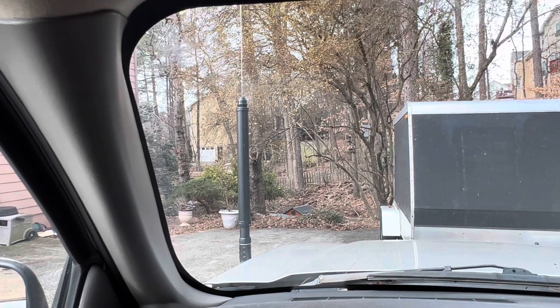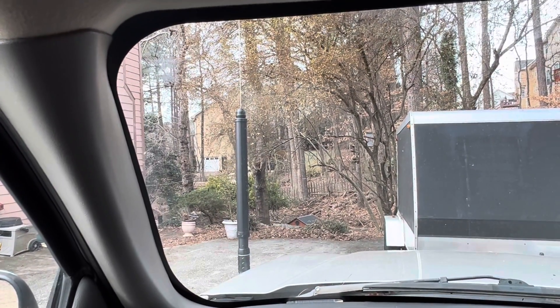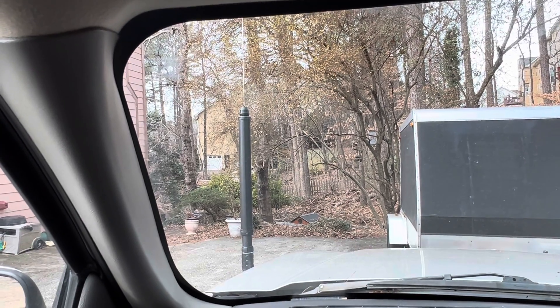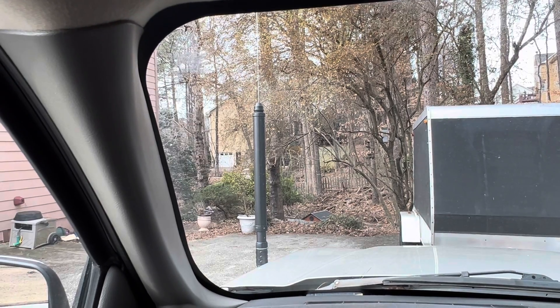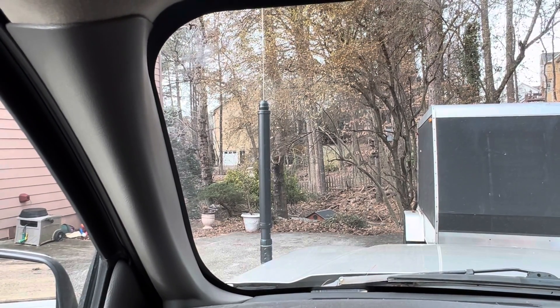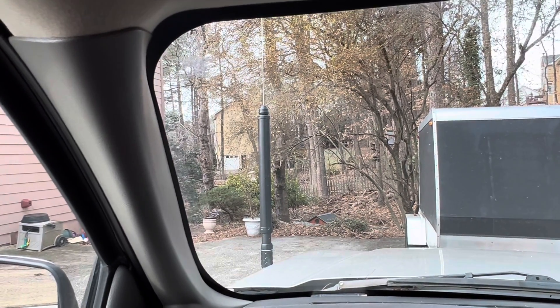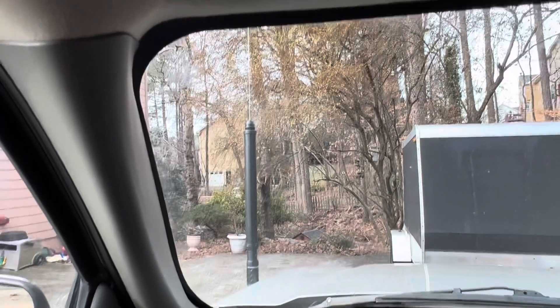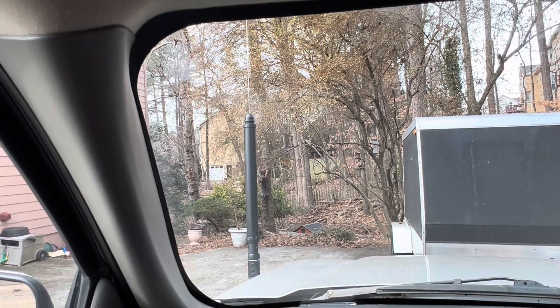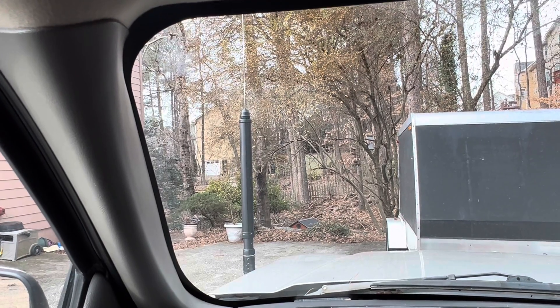The lowest I ever got was 55, and I'll take that. In fact, I got 55 even from sitting here in the driveway. I was working him on the way home from a short errand. It's not mounted dead center on the top of the vehicle, so it's going to have more of a skewed pattern — a major lobe, some minor coverage in other directions, and a null. But that's okay, it's convenient, and I was able to talk to Iowa with it. I've heard from many viewers that they've worked the world on it, so I'm confident it's going to be a really good combination.